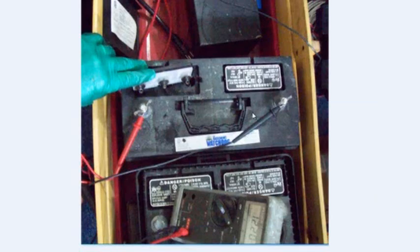As the state of charge increases and the battery is accepting electrons, the sulfuric acid generally becomes a little bit heavier. The specific gravity of that solution should increase. The sulfuric acid removes itself from the electrolyte and binds to the plates forming lead sulfates, and that density becomes lighter and more water-like as the specific gravity gets lower.